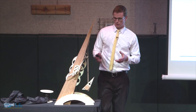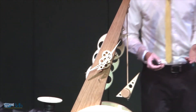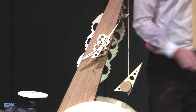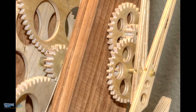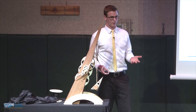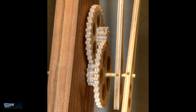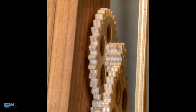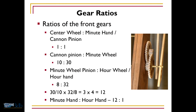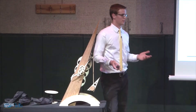All those ratios are to make this one gear spin at a certain rate, because the minute hand is on that same arbor. So whenever the center wheel makes one revolution, the minute hand makes one revolution — that's one hour. The cannon pinion has 10 teeth and it spins the minute wheel, which has 30 teeth. That then spins the minute wheel pinion, which has eight teeth, which spins the hour wheel and the hour hand, which has 32 teeth. So if you do the math, the minute hand spins 12 times and the hour hand spins once — just like a clock should.